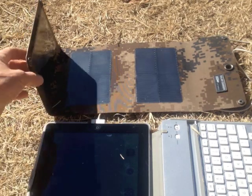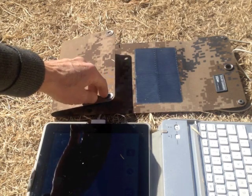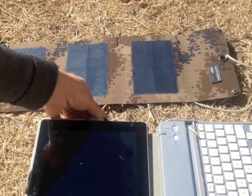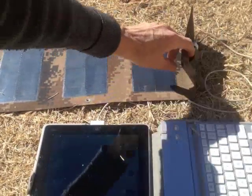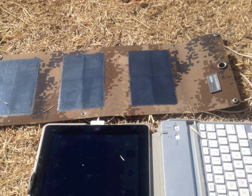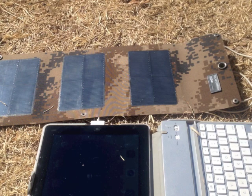I did notice that if I fully shade two of the panels and basically take them out, it will stop charging. However, it doesn't start charging again automatically. So if you have this in your pack and you think it's going to restart — I think this is a drawback on a lot of USB charging devices — they don't restart. To get it charging again, you have to physically unplug it and plug it back in. If you're carrying it around and go into a shady area and it stops charging, you might think you're charging all day and end up with a dead battery. It's not a fatal flaw, but it's something to be aware of.